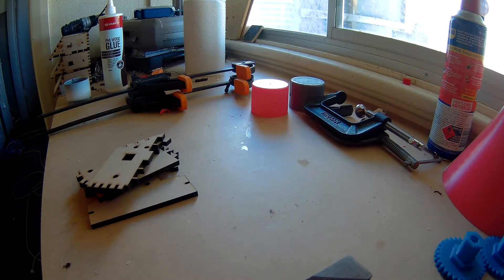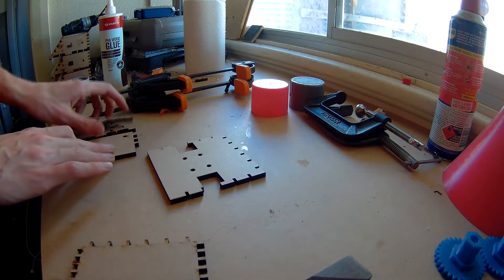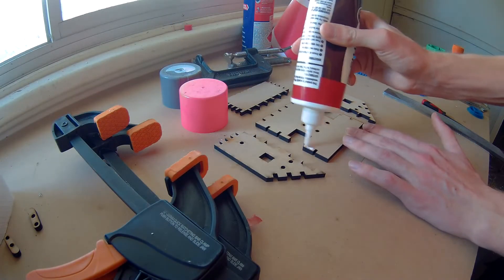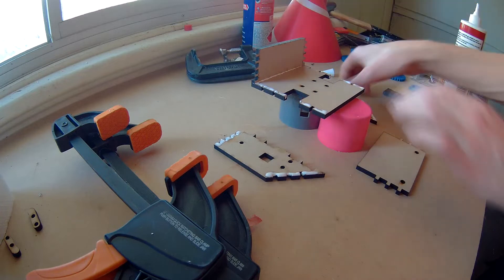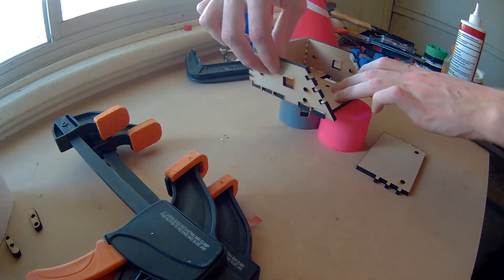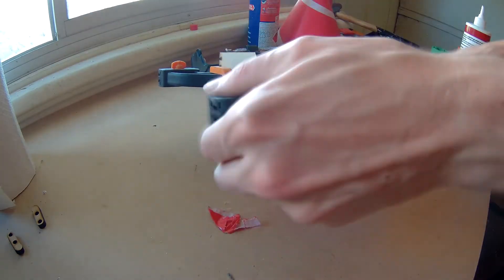The version 2 balloon poppers are made from 6mm laser cut MDF. This helps with rigidity and also build speed. These need to be glued together, which is literally just lathering glue onto them and pushing them in together. I don't bother cleaning off any of the burnt edges — it doesn't ever seem to matter with wood glue. Once it's all glued up you simply clamp it and leave it basically overnight, which I found was best.